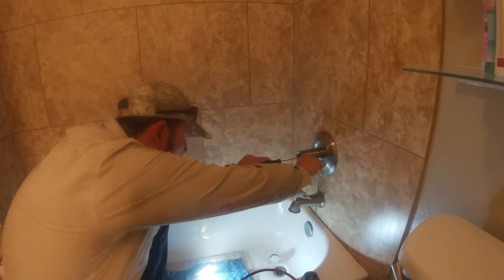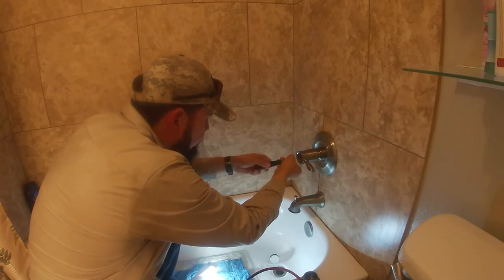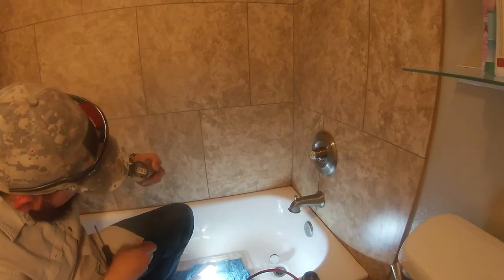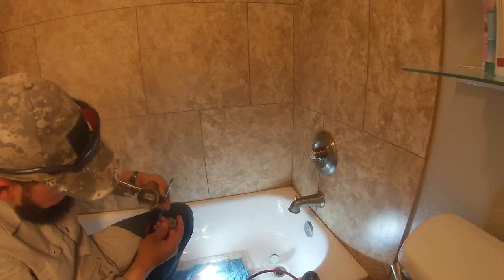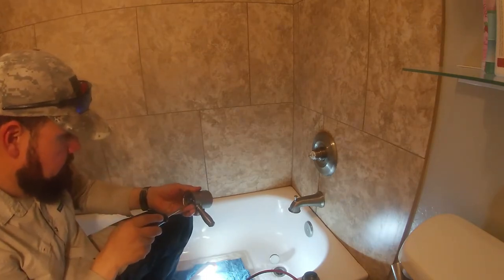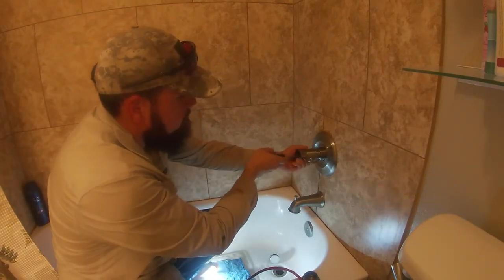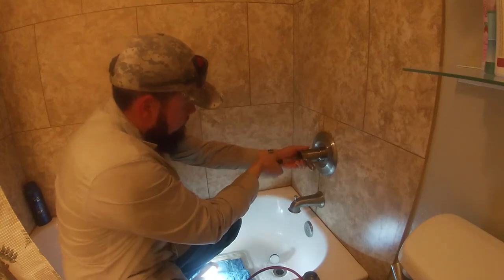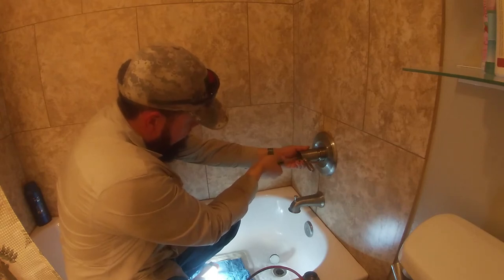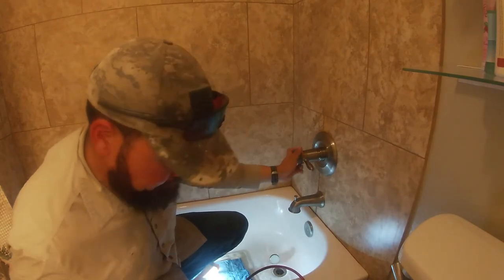That's why I don't like to use a lot of heat — if it's copper, it's going to soften the solder and it may leak one or two drops every few minutes, or it could be very visible. That's why I like to use a heat gun: it takes a lot longer but it will never get hot enough to melt the solder. Before you put the cover plate back on, you just have to make sure there are no water leaks inside the wall. After that you can go ahead and put everything back on. This job is not really that complicated — when I first did it, I taught myself how to do it. You just have to do it, and that's the only way to learn.